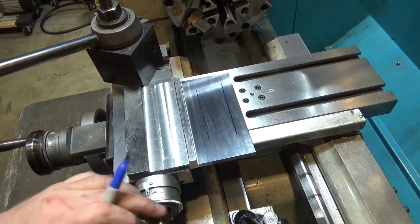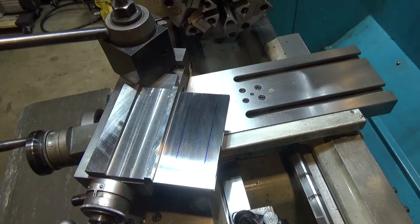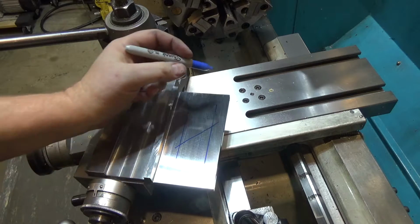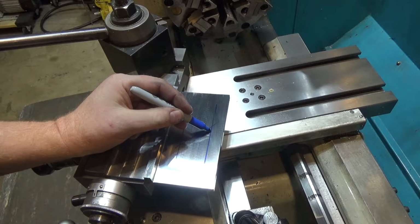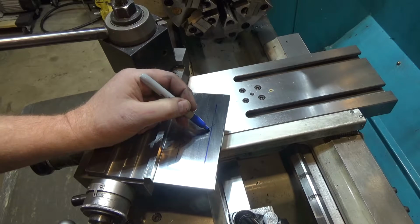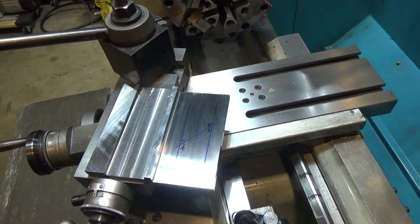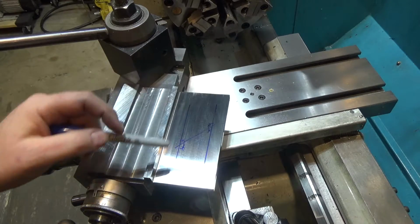Now, when you turn the compound at an angle, let's say 20 degrees, like this, the compound is now cutting those parallel lines across like this. And we're going to take advantage of a feature that says that alternate angles from a line cutting two parallel lines are equal. So this angle is equal to this angle, and also this angle is equal to this angle. And the sum of these two angles is 180 degrees, of course, because that's a line. But that's not as important. We're going to take advantage of the fact that alternate angles are equal.